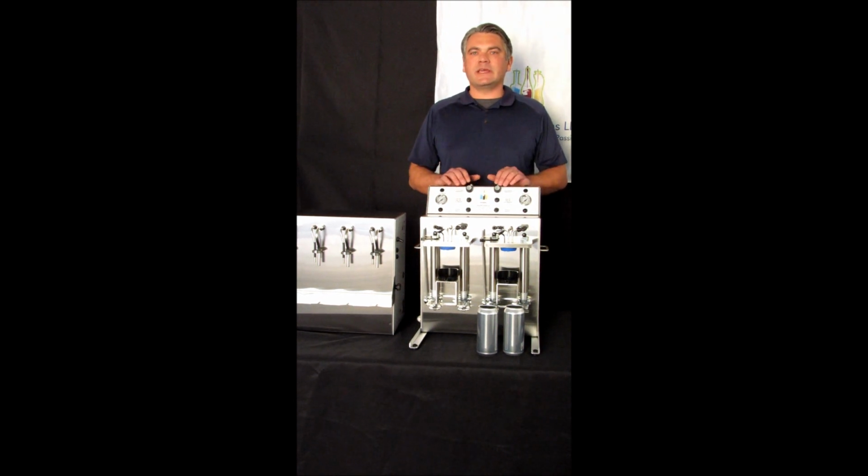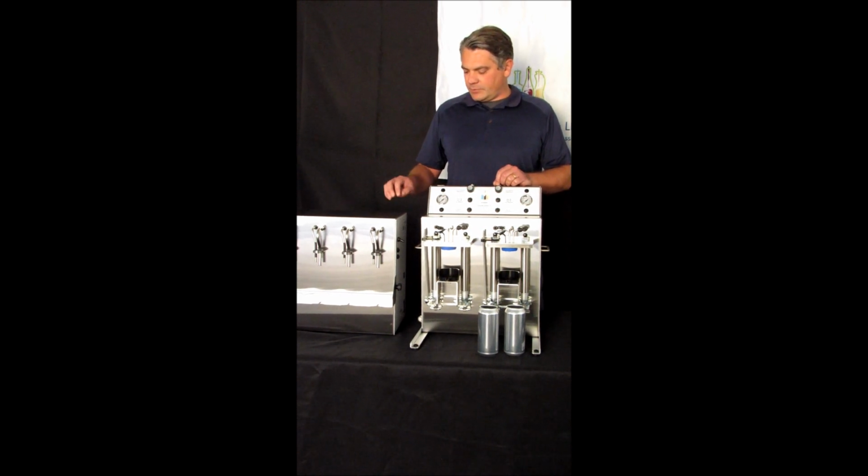So the industry is moving heavily towards canning, canned products, as far as we can tell. If you want to highlight some different features on those two, if you were in the retail business and shelf life is of importance, you definitely want to go with the counter pressure can filler. If you are selling your cans on premise and they're consumed normally within a week or two, the XF4400 is definitely a great economical alternate to the XF4500C. The XF4400 also has a smaller brother or sister, the XF2200, which is basically the same machine with just two fill spots.